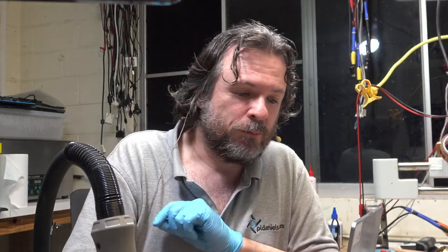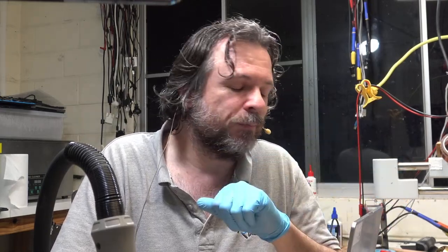It was an interesting one because we found some fake chips, or at least we believe they're fake. And of course, we did still find other issues on the board, so we fixed those up as well because they would have caused other quirky issues, like that resistor that would have resulted in the touch panel perhaps not shutting down when the lid was shut. And that corrosion that we saw could have caused issues with voltage regulation, I think it was. I can't remember. Anyway, the point is, it's a good thing we found those.